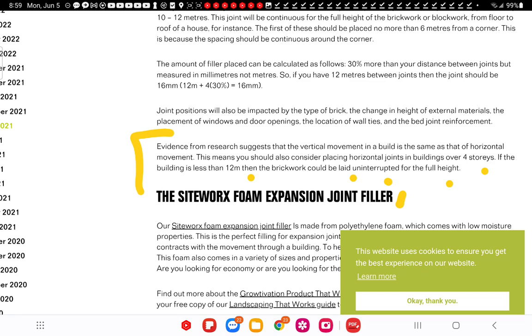And in this case, we have this lime mix. So if you get some expansion, some heat, you then get bond breaking if that lime mix does not expand like a rubber band, both directions, however this is expanding. So then you start getting breakage. And with breakage, you're sitting on top of loose lime, fine sand, if you will. Let's think of it as sand, a roller, little pebbles. And then you get water coming down, and when water comes down, it lubricates those little pebbles. And the brick goes sliding off out to the Neverlands as it's leaning forward, because initially the washout is in the front of the soft mortar. Then any other water that makes it back loosens it and starts sliding, drifting forward, forward, forward, and ultimately slides out and onto the ground. It's kind of as simple as that.